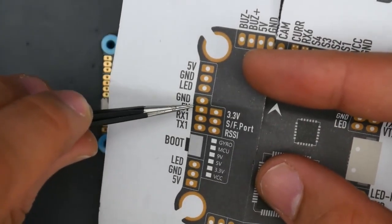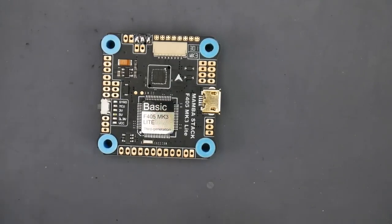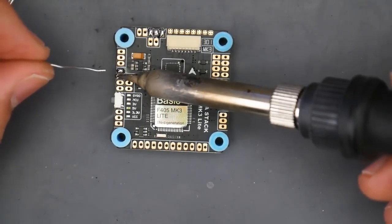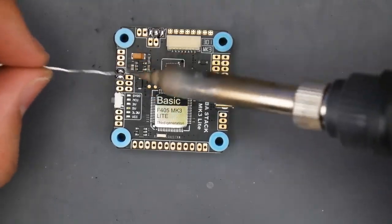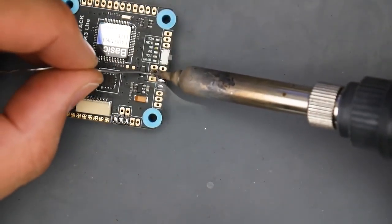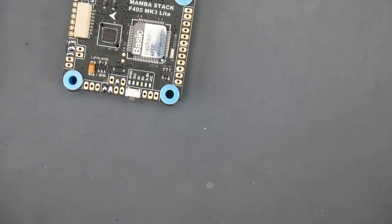So we're going to solder to this one and just give it the power from here. Let's go ahead and set that up as well. We said we needed this pad right here, so we'll just set that up. Then this next pad right here and the middle one. I don't want to touch that component, so I'm just going to flip it over and add a little solder like that. So now we have our receiver part pretty much ready to go. We'll start soldering it soon.